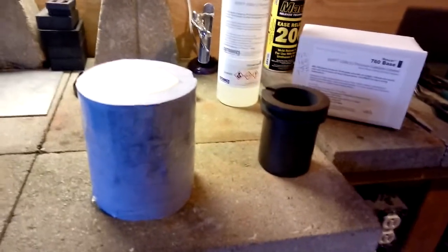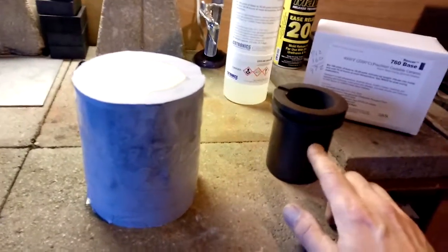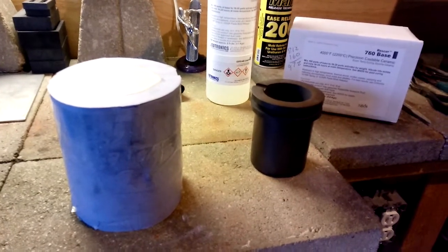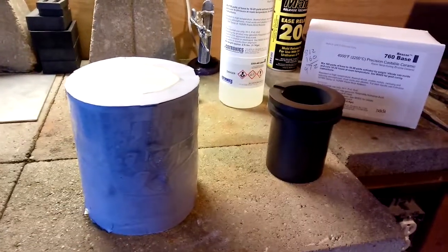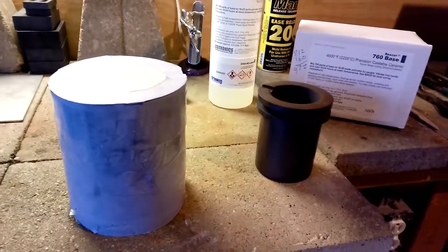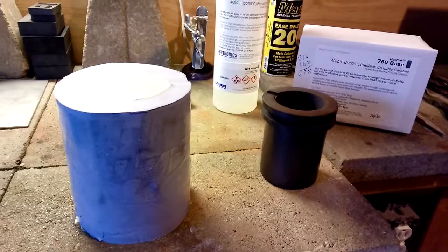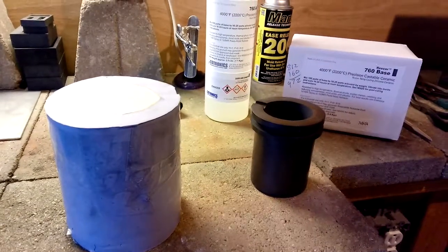A little update video on the ceramic coating for the crucibles — it was okay, it saved the outside for quite a while, but the inside still deteriorated on me. I decided to look for a solution because I could not find a fully ceramic crucible anywhere online. I even called the company and asked if they had a ceramic crucible for these benchtop models of hardened furnaces, and they said no.